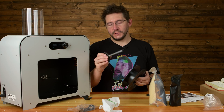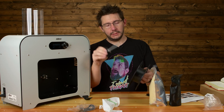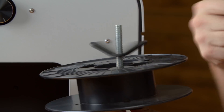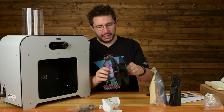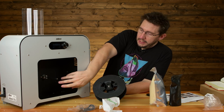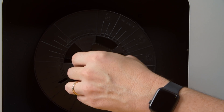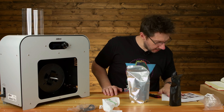Here's the empty spool. It's really interesting what they do when they want to spool something — there's this little folder, you put it in and then you tighten this down. This tightens around the spool, keeps it centered. There we go. So the spool is now tight against this, and then what you can do is insert it right here. There are magnets in the back and these little registration marks that hold it into place. Now it's magneted in, and when it turns it'll be able to hold the filament.